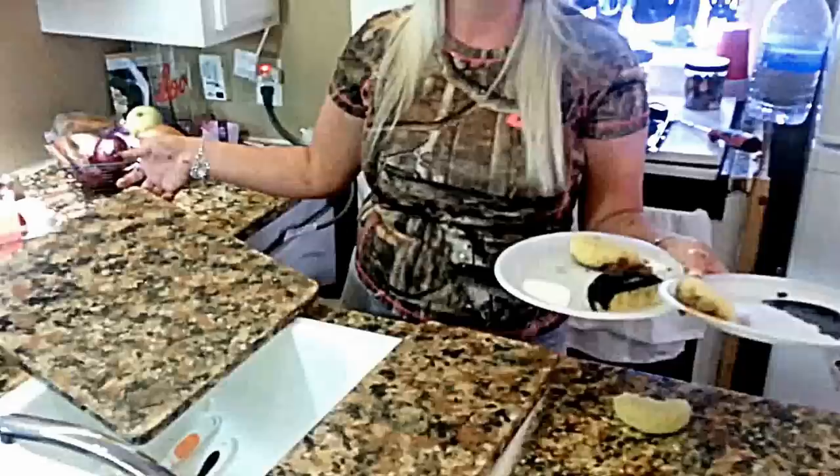I know when we put the oil base down, we were really quick to go ahead with the acrylic. That part's okay to do. However, when you get to the polyurethane step, be sure to let it completely dry before you start putting polyurethane on there. So we'll be back again once this is dry.